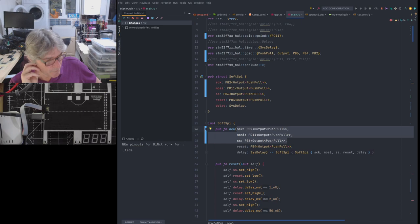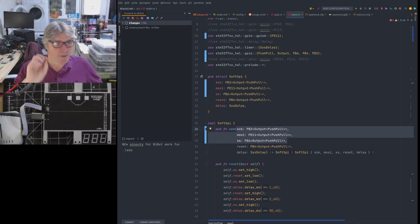So the problem we have here is, even though we could send the data, every time we send a transaction, it will take the select line low and then back high at the end of the transaction. Now, given that we're receiving chunks of this over USB, we're not going to store the entire image when we're writing to it dynamically over USB. We can't start one transaction and then end it however many bytes later, because we'd have to store the entire image locally in RAM first, and that's going to be big.